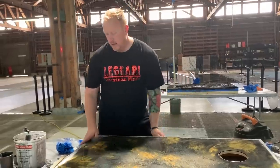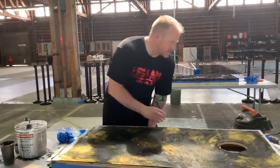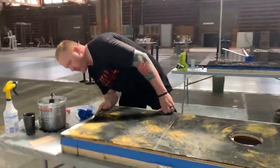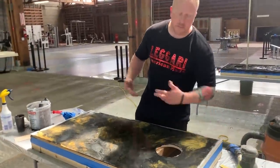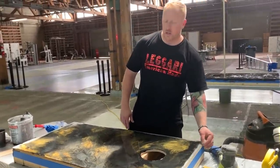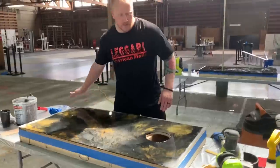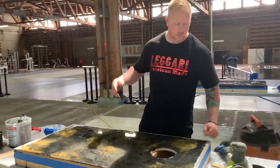If it sands through in some places there might be a couple of thin spots where obviously that's the thicker part of the board. We'll touch that up with some black before we even do the urethane, so you won't really notice the wood look on the edge of the board where I sanded through. Not too worried about that. We'll just keep going and then the urethane will bring all of this sanding right back.